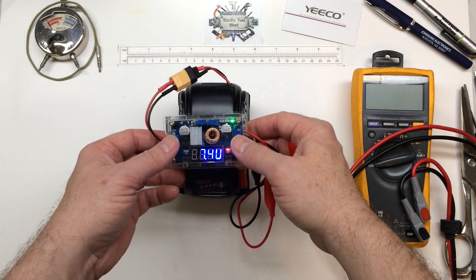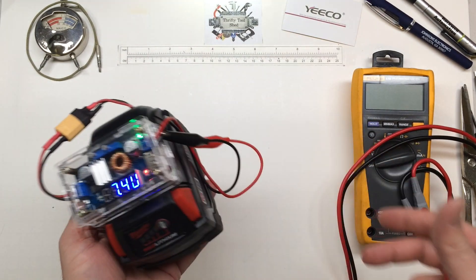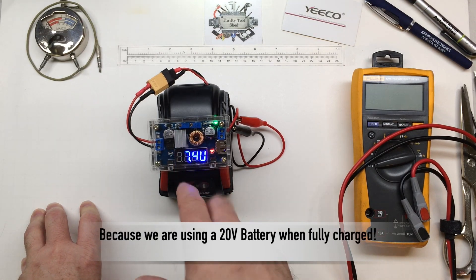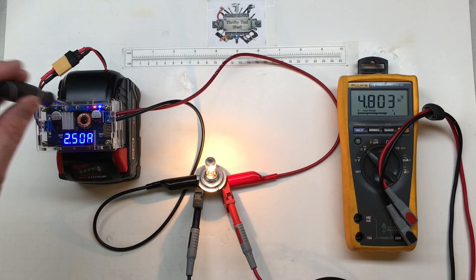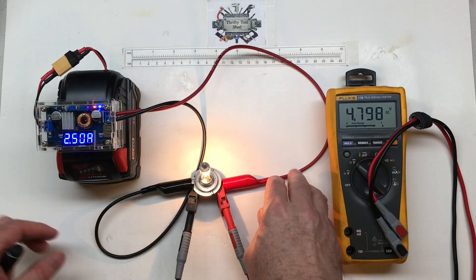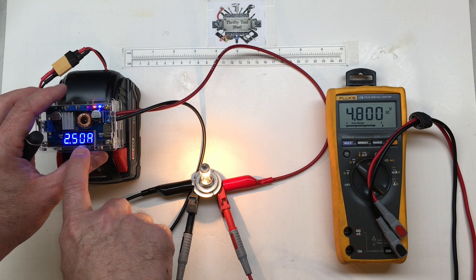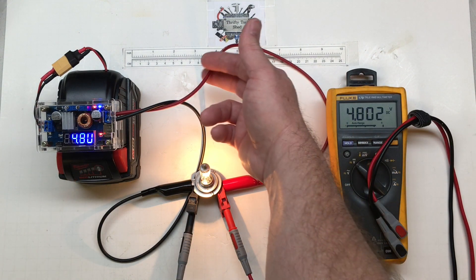With a piece of double-back tape, we can make ourselves a really neat little portable variable output, five-amp power supply. In this case it can be 1.25 all the way up to almost 20 volts output, current controlled and voltage controlled, five-amp output. I thought I'd better show you I do have better leads — just to show how the better leads hold up, we toggle through, set it to two and a half amps, and we toggle through to showing the output dead on. These leads really aren't losing much.